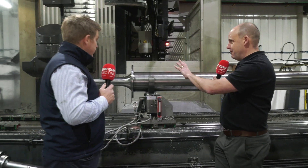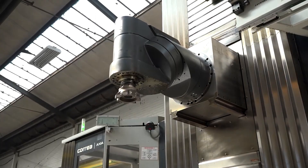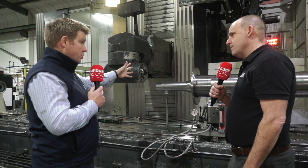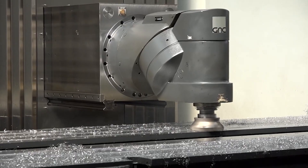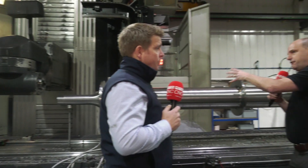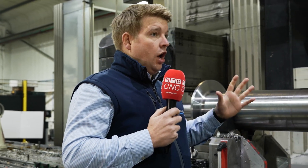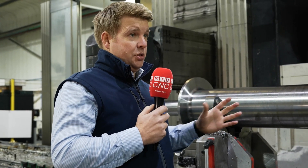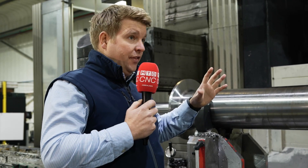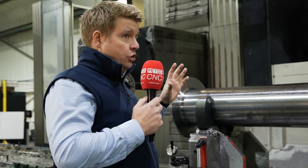Okay, and then the head technology — this is slightly different to what you'll see on the Norma, but the principle is the same: being able to get to lots of different angles. For us, we do a lot of face working which is what it's set up for now, and a lot of angular drilling — this head is specifically designed for that kind of pressure through the head. In terms of where this machine fits in your machine shop: this machine fits where we've got a lot of milling, drilling and many operations on one part, so more hours on a specific part. It's set up for longer runs with less moving of parts, so we can keep fixtures, settings and steadies on, and it allows for larger elements on the bed because the bed is stationary.